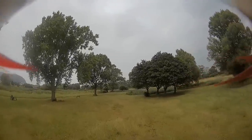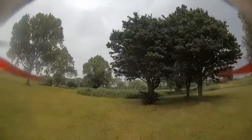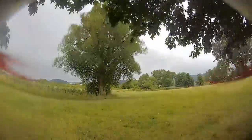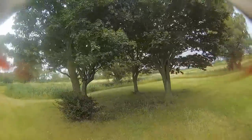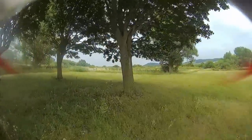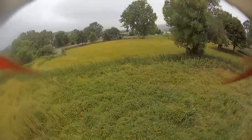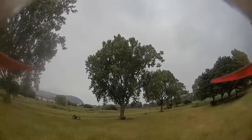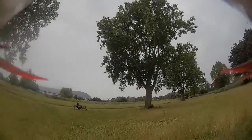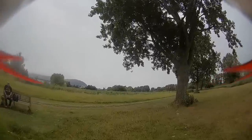With that last release, whilst things weren't perfect they were much better than this. This is just a very basic shakedown fly around the trees to see how it performed, and I'll be honest it looked a lot worse in the goggles than you're seeing here in the footage — so much so I actually thought something could actually be wrong. I tried different modes: 25 megabits, 50 megabits. This is in the low latency mode at the moment but it was exactly the same even in standard latency. The codec is simply not able to handle repeating green areas just like you're seeing on the screen here.